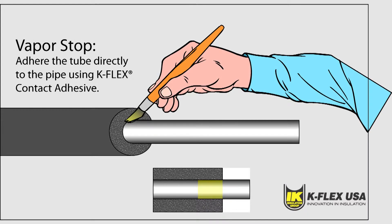For applications subject to heavy moisture, such as wash down areas, Kflex USA recommends caulking all pipe seams. For refrigeration and all other below ambient applications, Kflex USA recommends that you install vapor stops at all insulation terminations or interruptions. This includes supports, valves, and flanges. Start by adhering the insulation directly to the pipe using a two-inch strip of contact adhesive or sealant to maintain closure. Insulation tape can also be used for this purpose. On straight runs, install vapor stops every 18 feet or 5.4 meters to minimize moisture problems.